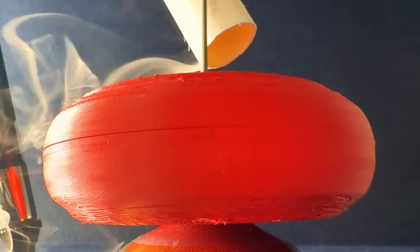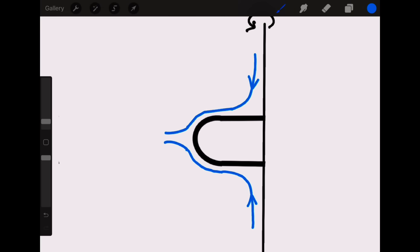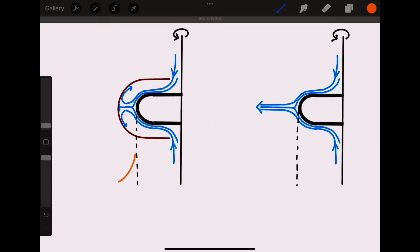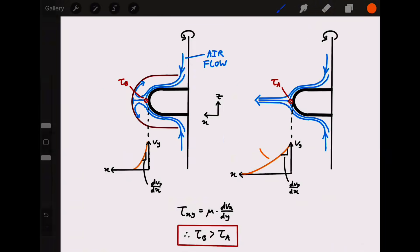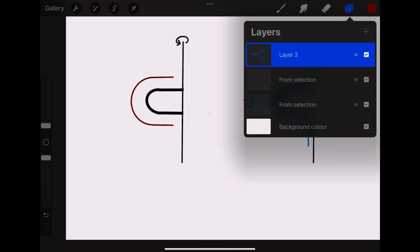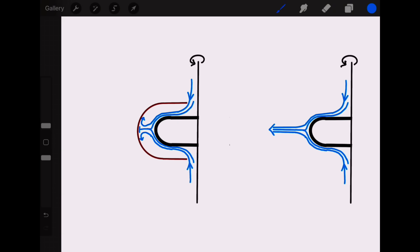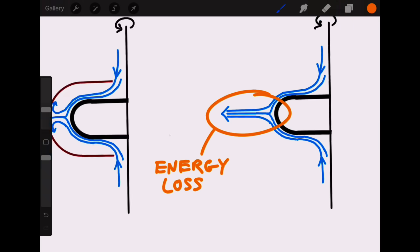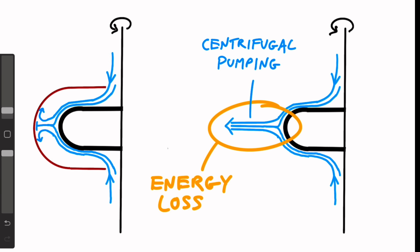Now, if you're familiar with the idea of boundary layers in fluid flows, this may come as a surprise, because putting a stationary boundary closer to the top should make the velocity gradient steeper, and hence shear forces and viscous air drag greater. And you'd be right, but the bigger picture is more complicated. Do check out the paper in the description, but to my understanding, although shear stress is a factor, the total air drag of spinning tops is actually dominated by large-scale flow structures and pressure effects. Shrouds contain this flow, lessening centrifugal pumping and reducing overall energy loss, even if the boundary layer shear is higher.